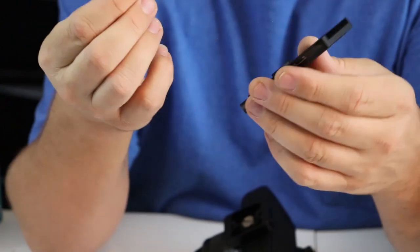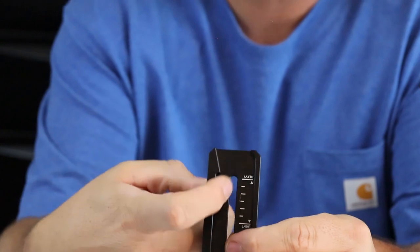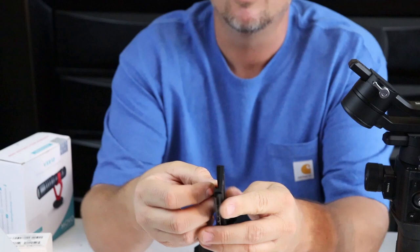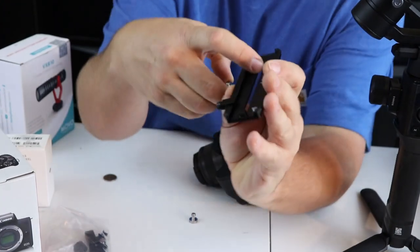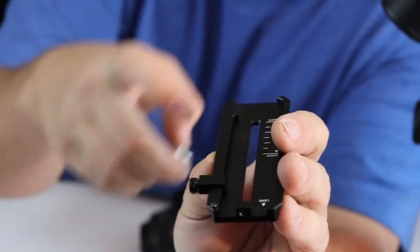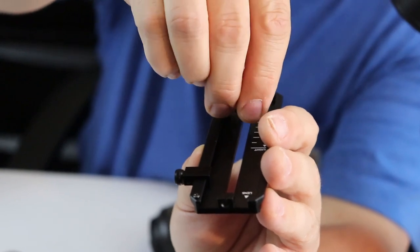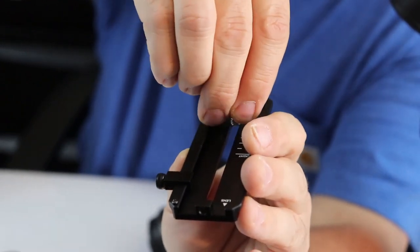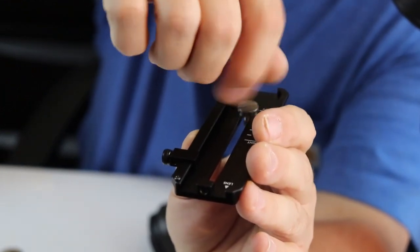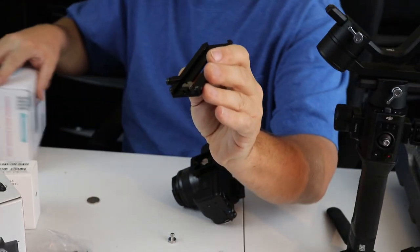So if you're trying to get them in and you're thinking, oh, this screw doesn't fit, well, it's because at the top, it's like a beveled extended part of the rail here. It turns into like a hole shape at the very top up there. So what you have to do is, and it actually has threads in that little hole there, which might be hard to see, but if you look closely in there, there's some threads, and that's where this little screw is going to thread in there like so. And I know that takes just a second, but once you screw it in, it's gonna drop down into the rail like that, and then there it goes. Oops, excuse me, dropped that, but here we go with the second one.